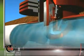When the plugging head has fully penetrated the pipe, the head unfolds and the water flow is blocked. Next, the plugging heads are folded and withdrawn through the sandwich valves.